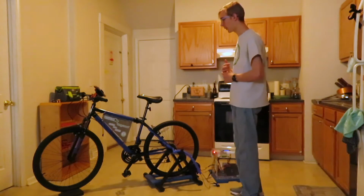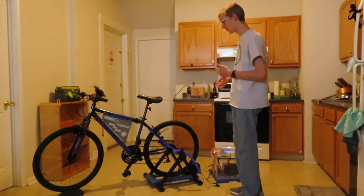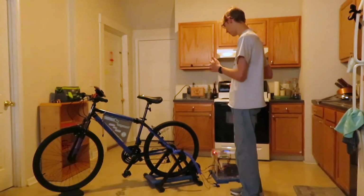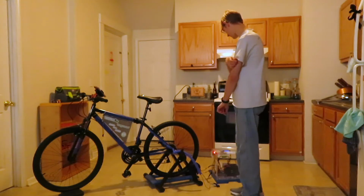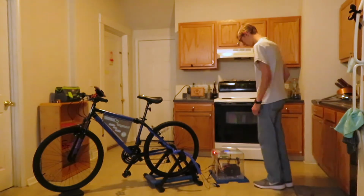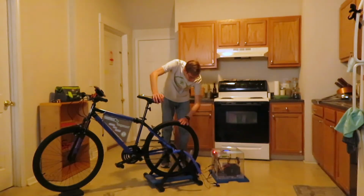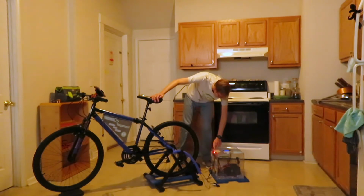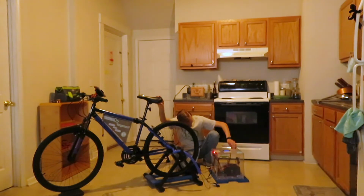So basically, we had a bicycle, and we put together some stickers, some stands, just made it look nice. And then once we had that, we made an electric circuit, and we put that inside of a plastic box. So how it works is, when the bike is pedaled, it turns an electric motor, which feeds power into here and charges two 12-volt batteries, which are wired in parallel.